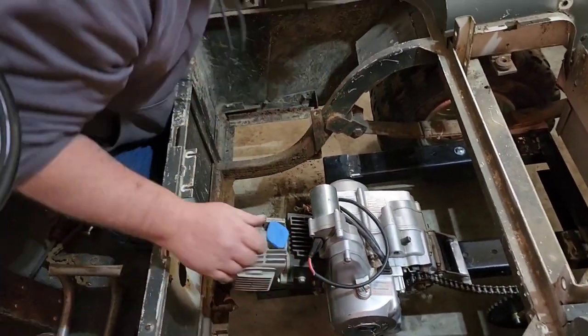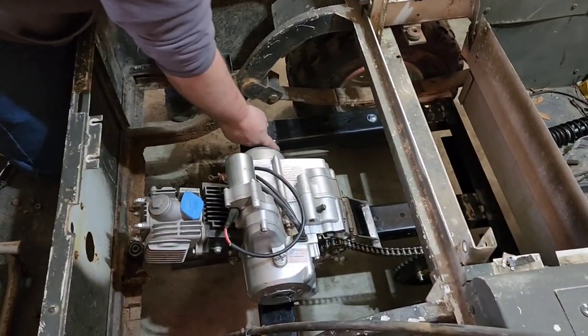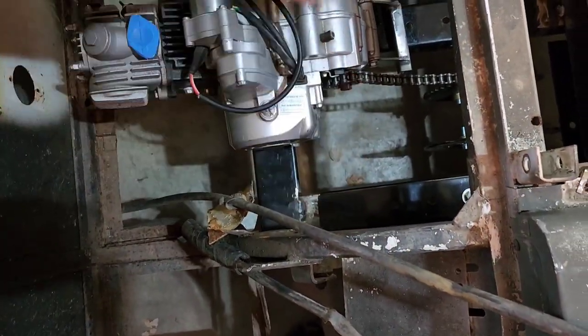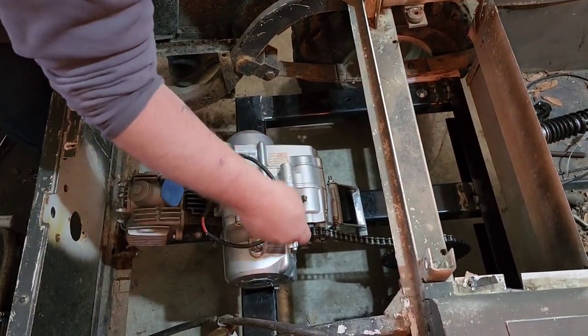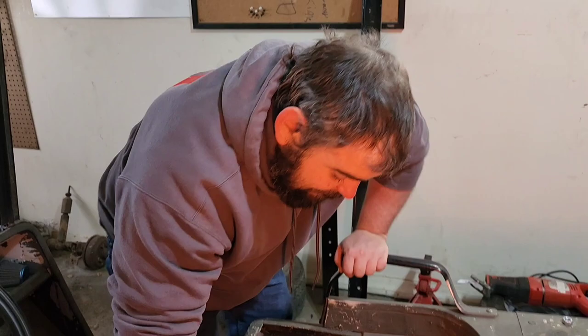And then now my plan for the top mount is I'm probably gonna bring a bar off of here and a bar off of here, and then weld a bar across the top of those two bars, to where I can bring two ears down from the top bar to go through this mount. That's what we're gonna try to do. So let's figure it out.